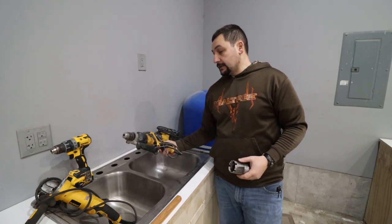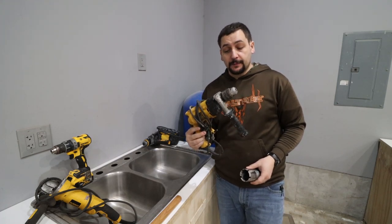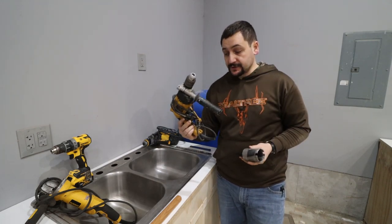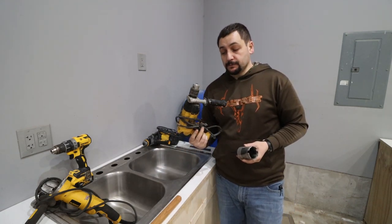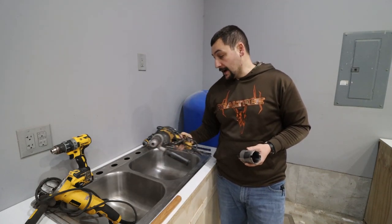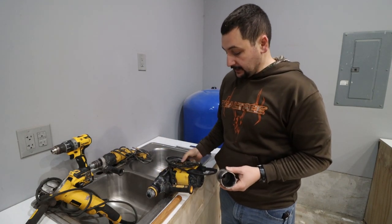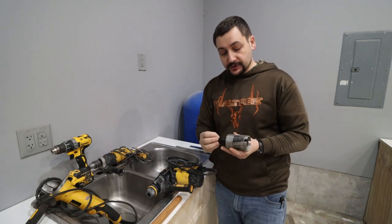A lot of people who don't have a cordless drill probably have a corded drill. This one happens to be a hammer drill with a switch for standard spinning and hammer mode — I didn't use it in hammer mode, but you could. Same thing: with the adapter you could use it with this bit. There's usually no e-clutch on corded drills; they're made for high RPM. Getting into concrete drills: the adapter I bought has specific grooves made for concrete drills. This is the concrete drill adapter.